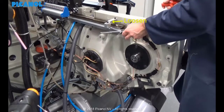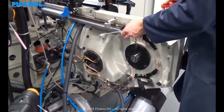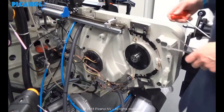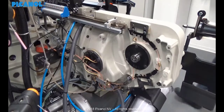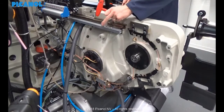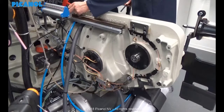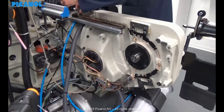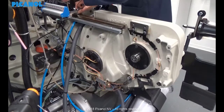After putting thickness plates under the support, you have to check the clearance again. If the clearance between the bridge and the support is gone, you can move the bridge to its maximum inside position and do the same procedure over again. Watch out that you use thickness plates here if there would be a clearance between the bridge and the support.